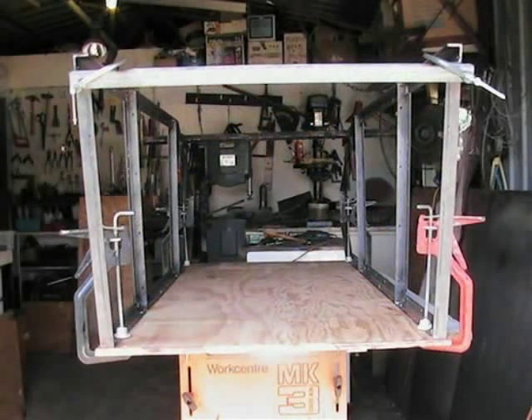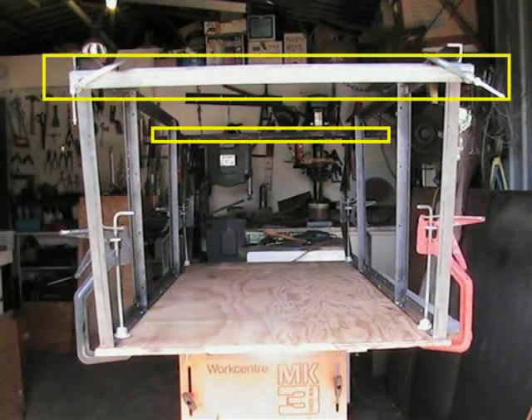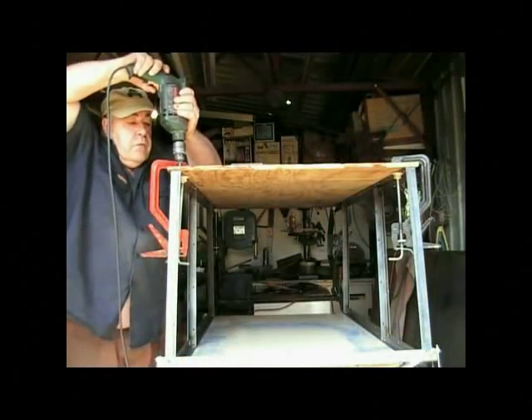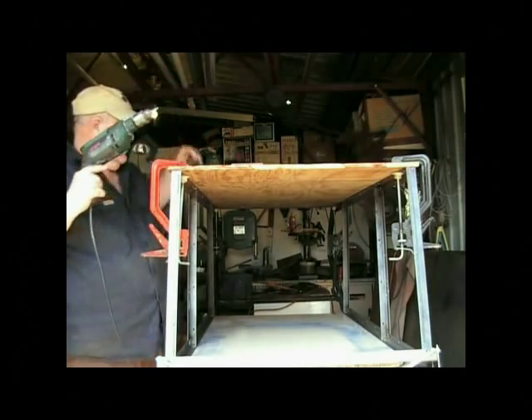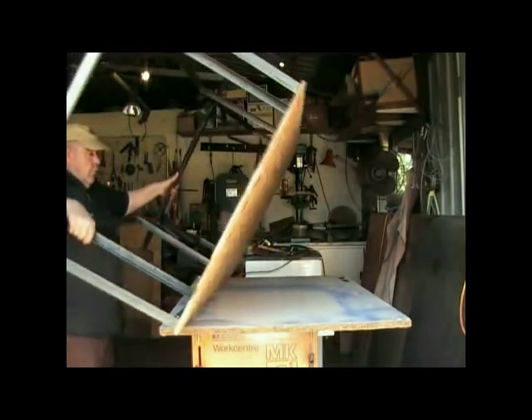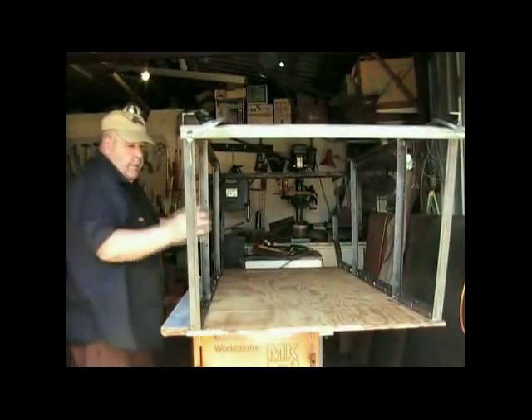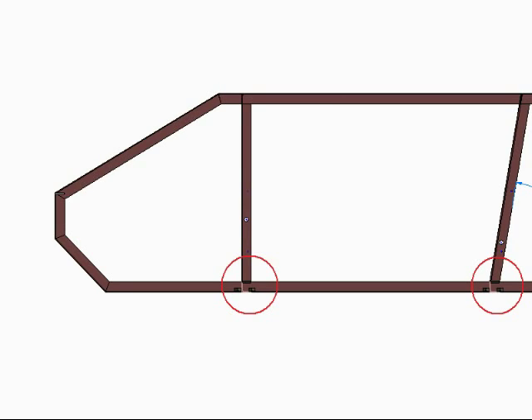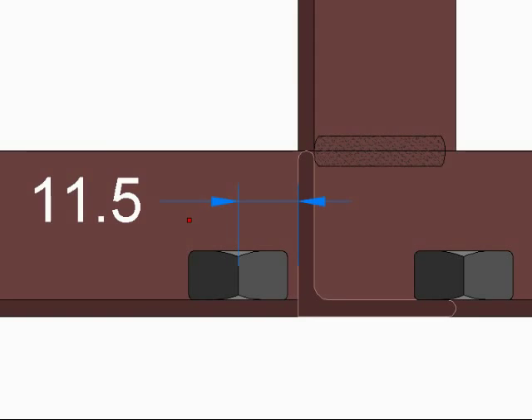When you've done that, you will need to brace the frame in preparation to invert the hull so you can then screw in from above to make it a whole lot easier. Invert the hull so it's the right way up so that you can then proceed with the construction and fitting of the lateral framework. The 30mm steel angles for the base of the hull are located adjacent to the side frame uprights.